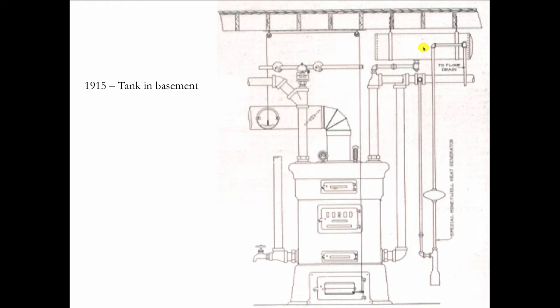So this is our first closed compression tank, not with a diaphragm. It's got an air cushion in there. And they figure out, well, let me just hook it into the hot water pipe here, the supply pipe going up, and that should be good. And then they put air in the tank and water, and it's about 2/3 water, 1/3 air. And as time goes by, they quickly realize that the tank is going to waterlog all the time. We're going to lose the air cushion. And it takes them years to figure that out, why that is. It takes them about 20 years to figure it out.